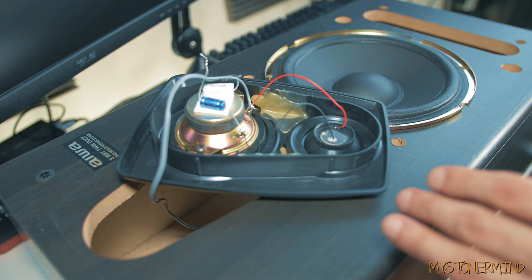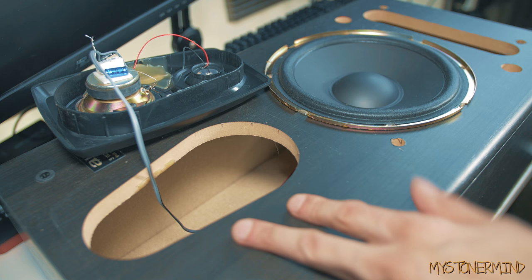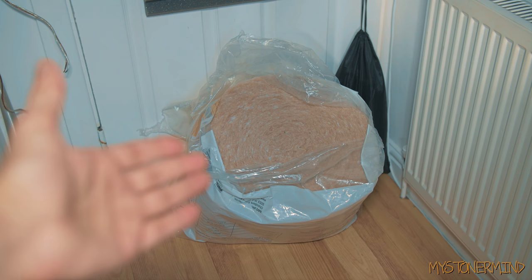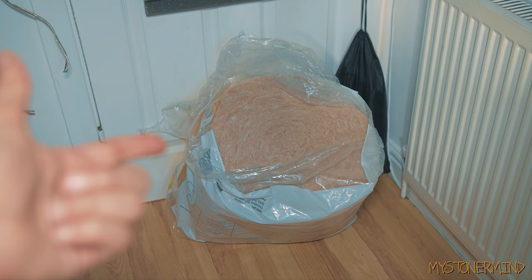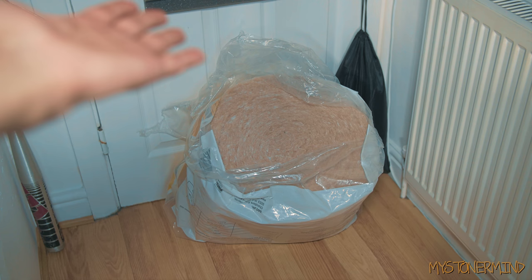Right now I've only got this hole right there — well, there is this port hole as well, but it's not very wide. So we need to stuff it with something, and I have just the thing. This is the stuffing I'm going to be stuffing into my speaker. I got this from my local DIY store. I suggest that you not use fiberglass to stuff a speaker cabinet unless you have iron lungs — this is made of recycled plastic. I've used this in all my speaker stuffing videos, even the big 18-inch sub that I have downstairs, so check out that video.